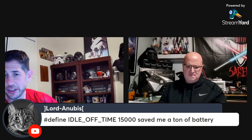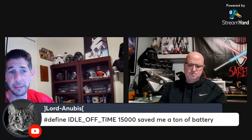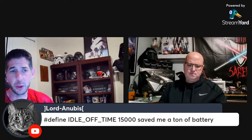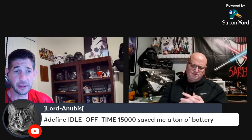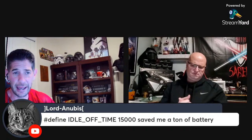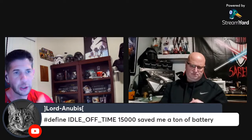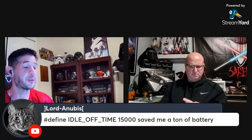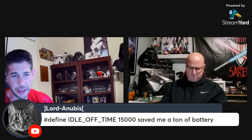I put that on all my Sabers, even Sabers that don't have crystal or accents, along with the motion timeout. Now, the motion timeout, there's some confusion on it. My prop file has an automatic 15-minute motion timeout. If you don't put the define in, it does it on purpose. Leaving the motion active for when your Saber's in idle mode or whatever, you are wasting battery, because it's still looking for motion that's never going to happen. So by default, my prop, even if you forget that define, does it for you. But you can extend it or shorten it if you use the define.